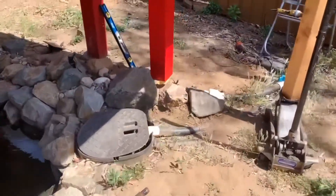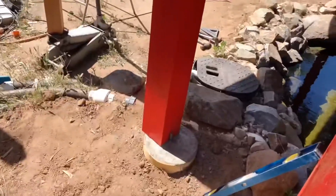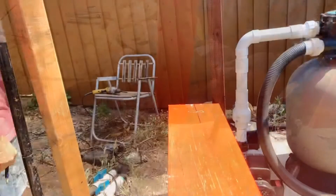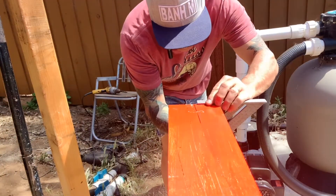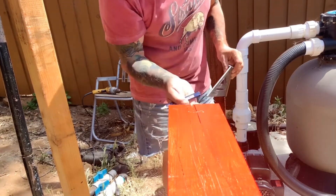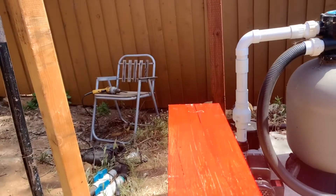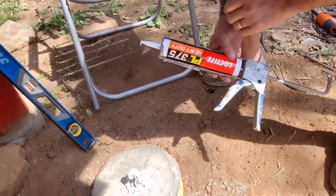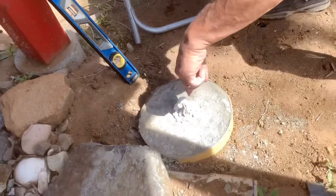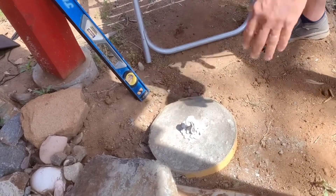What's going on — I already got my post all cut and measured and everything. I'm just going to make some marks so when I drill my 9/16th hole in the bottom of this, it'll fit down on the rebar. I decided to use my heavy duty Loctite — I use this for a lot of stuff, it's called the PL375 — and I just put a whole bunch of it around the rebar and then around the base so when I set my post on it and it hardens up, it just makes it stronger because it's more joined.